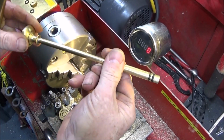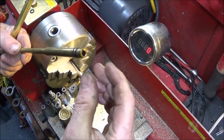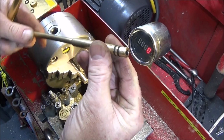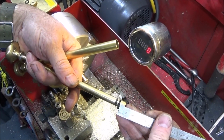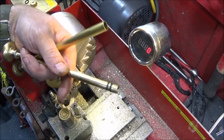And this is the piston from the one I made previous. You want the O-rings back a bit from the front face because there's a small bore in the front there in which to put the char cloth. So I machined the first O-ring groove about 8mm from the end face.